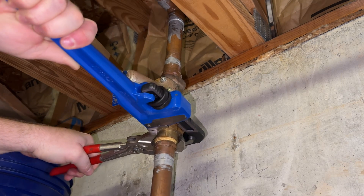I was able to get a good grip on this so I was happy with just going one turn after I got it hand tight. Now it's time to put your union nut back on — this took me about 24 seconds for it to finally catch the thread, so don't feel bad if it takes you a little bit longer. Just make sure you can go quite a few rounds so you don't cross-thread it, and make sure you hold back on the bottom fitting so it doesn't turn. You don't need to pipe dope or thread tape those threads because it's got the O-ring — the nut doesn't hold back water, it's actually just a friction fit so it doesn't need dope or tape.